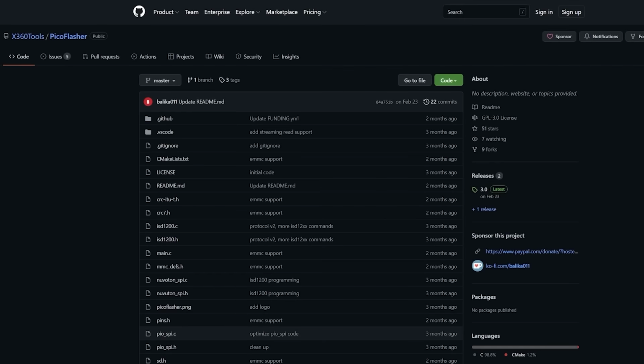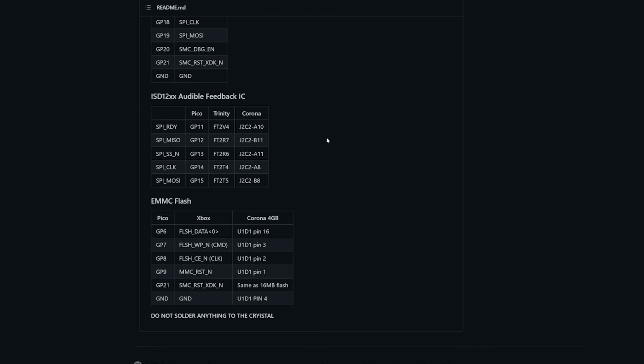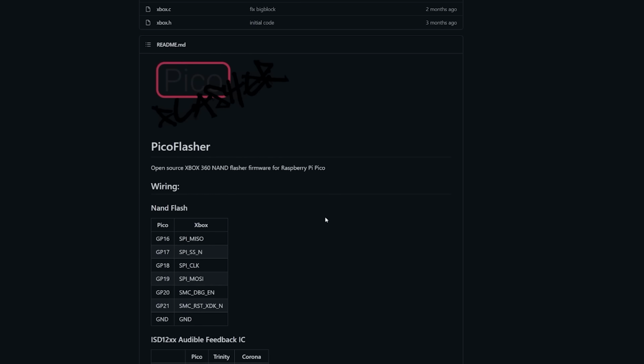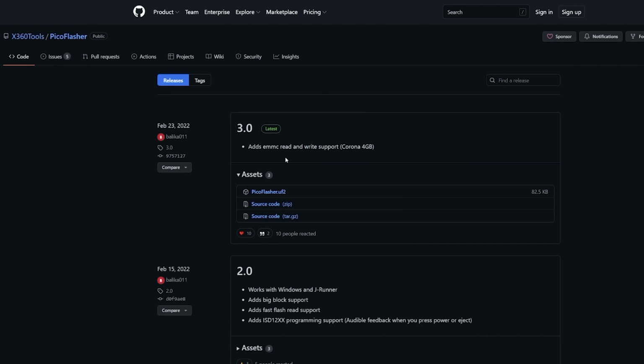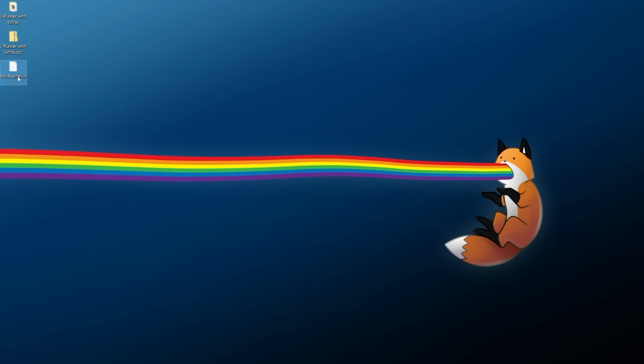Now, if you're going to choose to use PicoFlasher, you can absolutely do that. I'm going to have the link for PicoFlasher down below in the description that has been provided and created here by Balika011. Now, this GitHub might look a little daunting, and you can read up on the PicoFlasher here if you'd like to, but in order to get this all installed, we're going to just have to come up here, click on releases, and download the latest release of PicoFlasher. You're going to download and save this PicoFlasher.uf2 file somewhere you can easily find it. Just like before, I've saved this to my desktop.